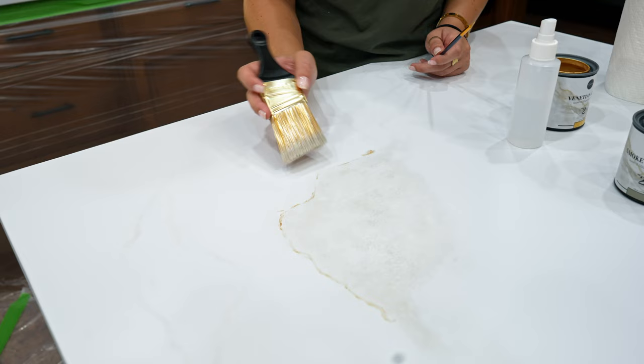Next, use the foam roller to evenly distribute the epoxy over the surface in your section. Since the epoxy is self-leveling, try not to overwork your application. It helps to hold the handle gently between your fingers and thumb, and lightly push the epoxy over the countertops. This will keep you from gripping the handle too tight and applying too much pressure. Too much pressure can spread the epoxy mixture too thin and cause defects in the cured finish. To make sure they're fully coated, lightly roll the front edges of your counters.